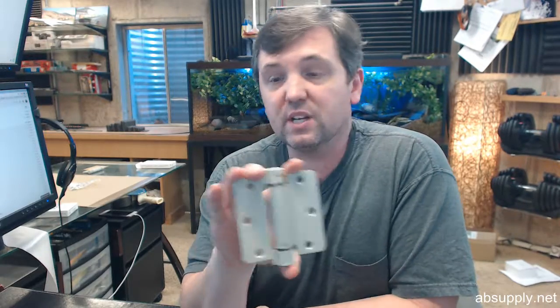Now, spring hinges, in my opinion, aren't a way to control a door because it's a spring. There's no control over it. Versus like hydraulic control, a surface overhead door closer, or an overhead concealed, or a floor closer. But the truth of the matter is there are times when only a spring hinge is permissible to get a job done. So there you go.